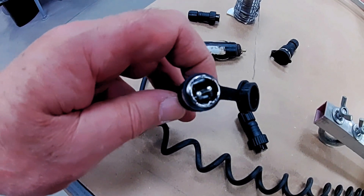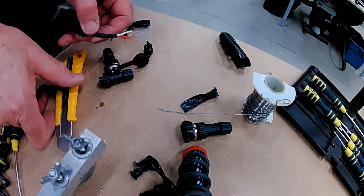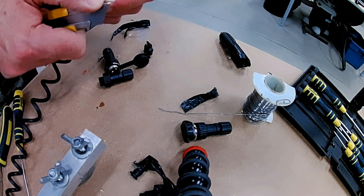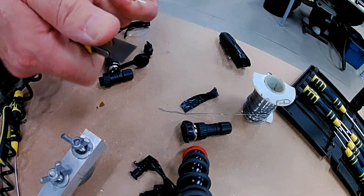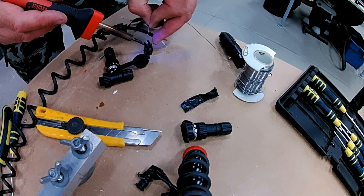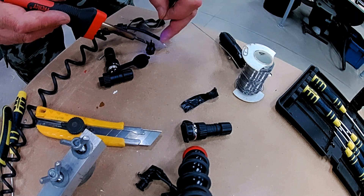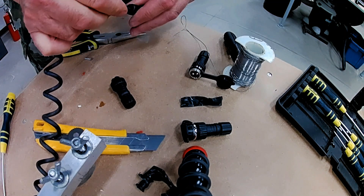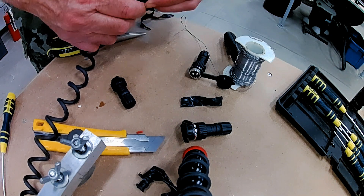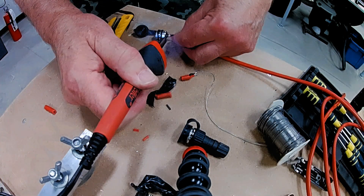Let's get that changed out and I'm also going to make an extension cable. We're going to go with the premise that one is hot and two is neutral. Don't forget to tin all of your contact points before you actually do your soldering. I found these aviation style connectors on Amazon, and I think they're going to make a really good, much more consistent connection than the old cigarette style socket and plug.